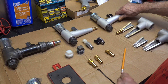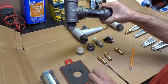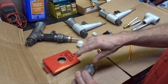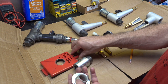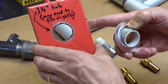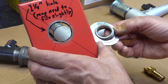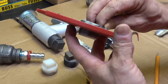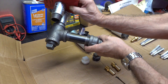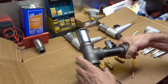I'll give you all the links down below this video. First of all, all of these work in the same way. They attach to the removal panel - the door, if you will - at the bottom of the cabinet, where you simply need to drill a hole. The hole should be about an inch and a quarter, might need to be just slightly larger. You take the top fitting off any of these three different metering valves, insert that with the washer, and then screw it in. That component is the same for all three.